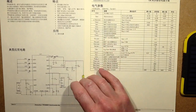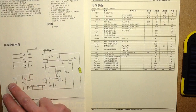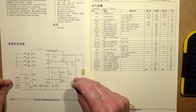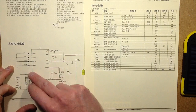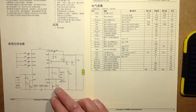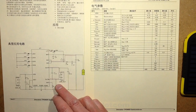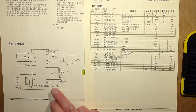There is one oddity: the input and output - the VDD in from the charge port goes through the current regulating circuitry before it goes out to the battery. The two USB sockets - I'm not sure what's in this chip; it would be nice to see a schematic showing what's inside. There's this random resistor labelled R3NC - I'm not sure what that is, but it connects between the USB out and... actually that might be a current sense resistor to detect when the circuit is being overloaded.